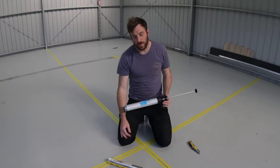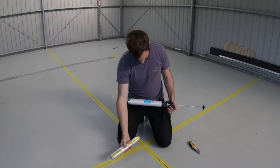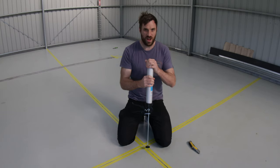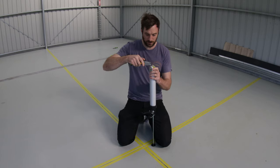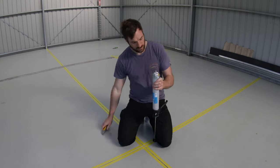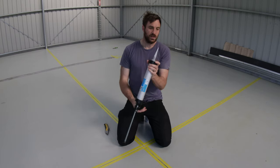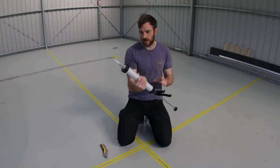To fill these gaps, what we've got is expansion joint sealant, and it comes in these sausage-like pouches. We've also got a sealant sausage gun. These just go on the sealant sausage gun like so — like a glove. Then I'm just going to cut the top open with my razor. Pressure should be able to get that sealant out. Screw the top on and we are good to go. I need to cut the end, just cut a little bit of the tip off, and that is ready to go.